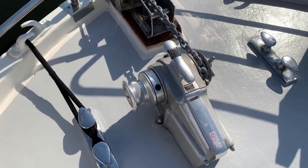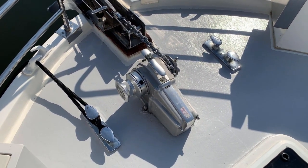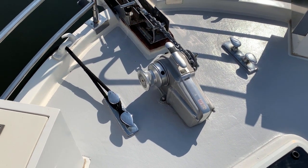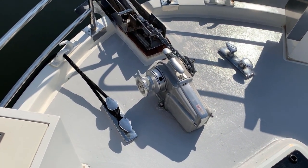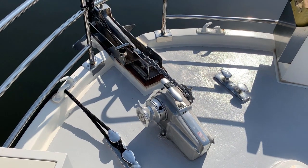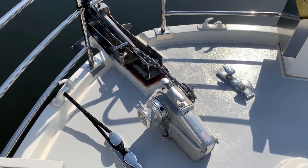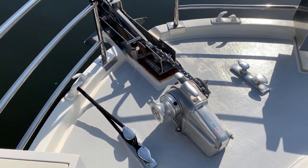We also put new timber and glass fibre laminate. So in the event of a tow, we've got plenty of strength up front. In the rope lockers, we have tow ropes, which we run from the rear cleats, wrap around this cleat, wrap around the front cleat on each side, and then are ready to attach a tow line. So the stress is then distributed throughout the four cleats.